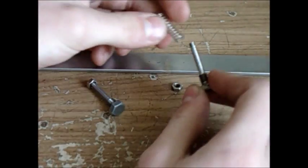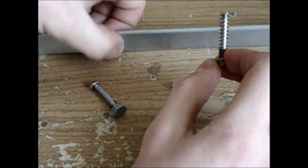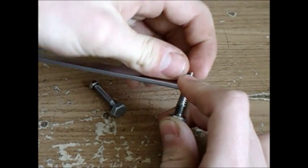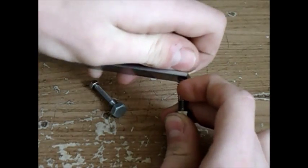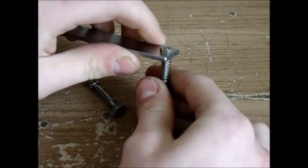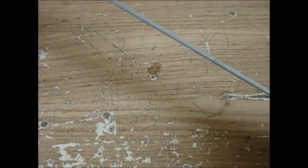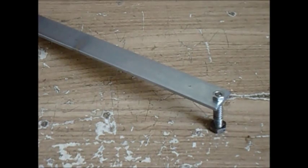These are going to be attached from below into the typewriter. Then you put up the spring, and this bar comes into action and goes onto there. It's going to be a little bit fiddly underneath the typewriter, but then you have the nut there to keep it, and you have the spring action — so this is fixed, and each time a key strikes it's going to press a little bit down, the same way on both sides. Now we're going to mount it underneath the typewriter so you can get an idea of this.